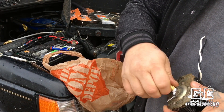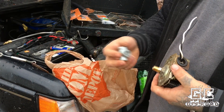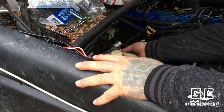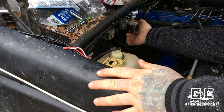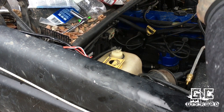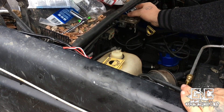That's a much better fit. I'm going to grab my pliers and just tighten that on down. This is the connector it'll fit to — threads on just like that. So I'm going to go over to the firewall now and see where we're going to mount this. I can mount this sideways to get it closer to the wall, or I can mount it with the sides sticking out. I'm probably just going to go ahead and mount this with the T-fitting going sideways across it. That way the larger side will stick back and I can use a hose clamp to mount the lines from it to the firewall and hold it in place.